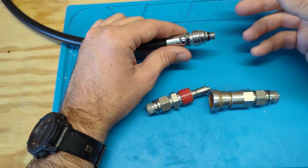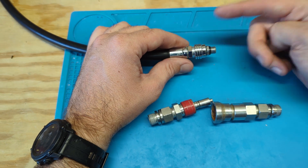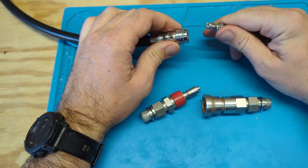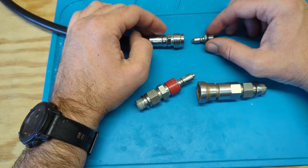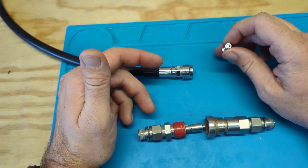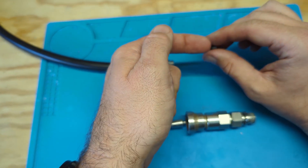This system is easy to put together and easy to take apart — it's a great fitting, but it has some drawbacks. First off, there's a restriction of gas volume that can flow through here just because of the design elements. That means we're not going to be able to breathe off this hose if we had it connected to something like a BOV; there's just not enough gas that can flow through the restrictions here.